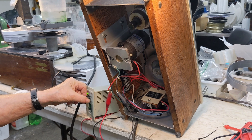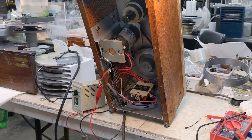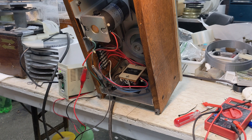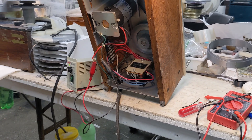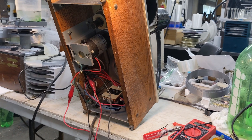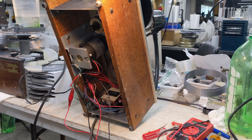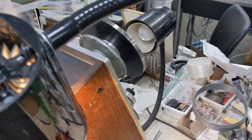There's nothing wrong with your motor — that seems pretty good. What was happening was the first time it tripped it took about 10 seconds or so, and then every time after that it was a shorter and shorter time before it tripped. The lamp goes through that fuse too, so if you get a defect in the lamp or the bulb it's not going to short everything out. These all work off the lamp through that fuse; these others don't have fuses.